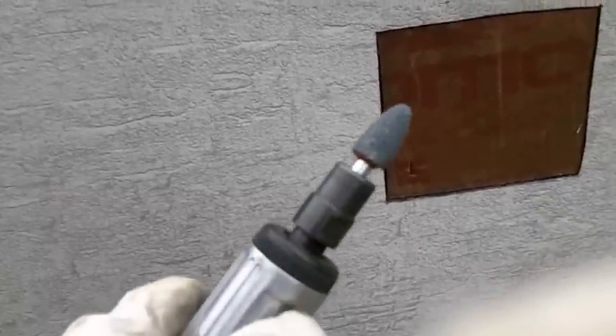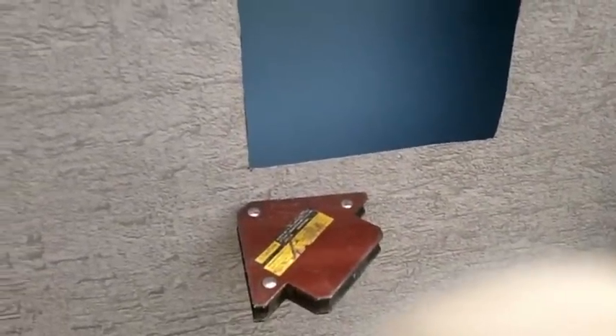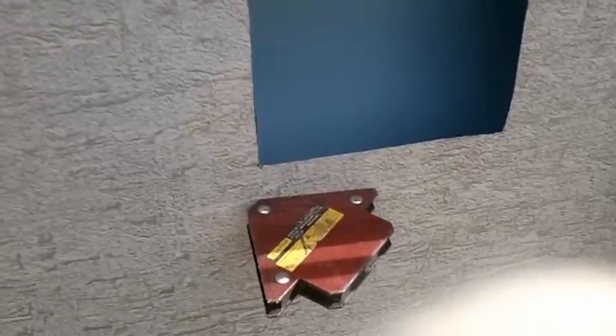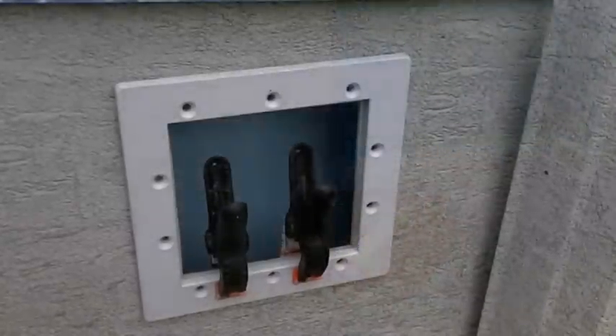I've got a hole in — looks pretty nice. I'll check it with my skimmer and make sure the gasket fits decently, then clean it up with my stone. What you probably couldn't see is a little magnet I hung on the inside of the pool wall to catch any metal shavings that might have fallen down. It worked great, and if you're going to try this, I strongly suggest doing that.